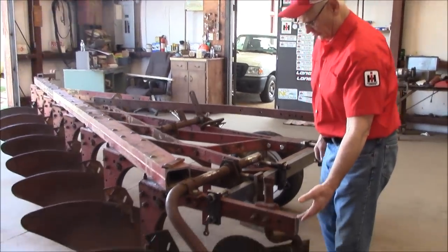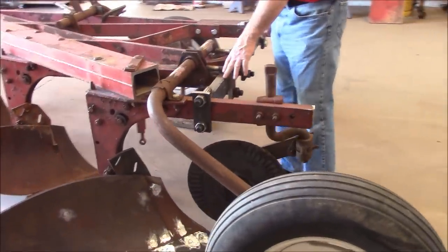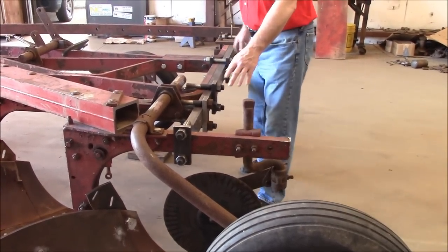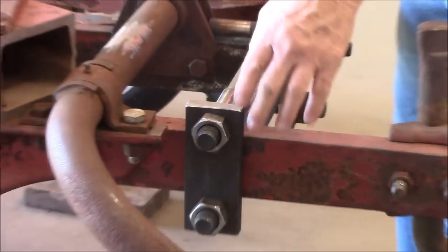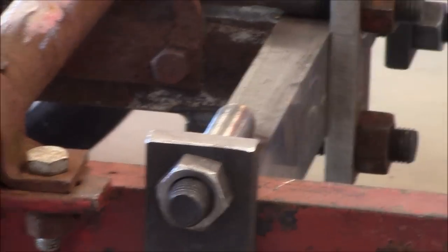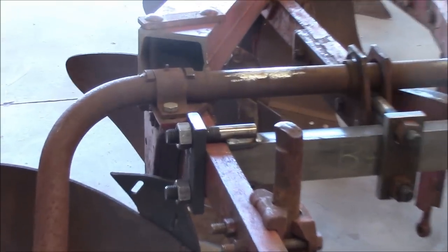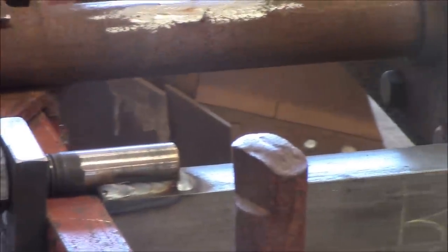This had a coulter works up front on this one. I had to add this inch-and-a-half by three flat bar across the front to strengthen this hitch up. These are inch bolts — cut the heads off, made these pieces at the machine shop, put them on there and pulled them up. As you can see, you can see all the joints, how nicely they pulled up in here. And I made some clamps.